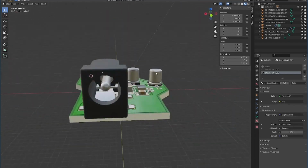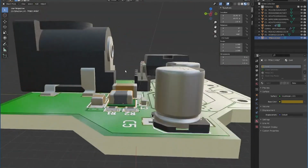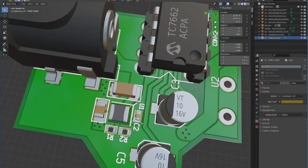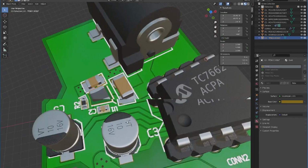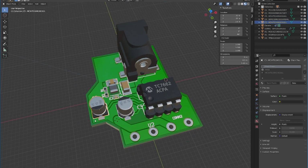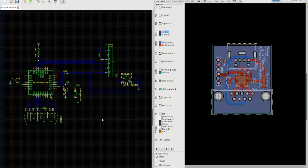So we've got the 12-volt input, we've got the little switching regulator, that's the whole regulator, there. Just one tiny little board with an inductor on it, a couple of capacitors, 2 resistors, that's the 5-volt part of the circuit done. We've got the charge capacitor there and the pump capacitor, output capacitor for the minus 12 volts. And that all goes to a 4-pin header which lines up, or should line up, with the pins for the choke, which this replaces.